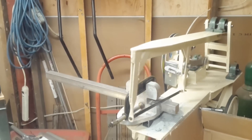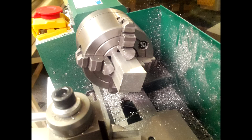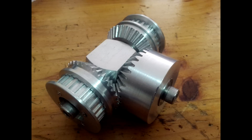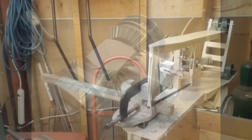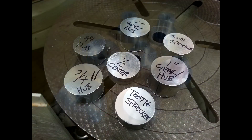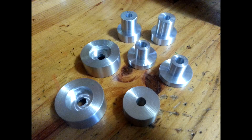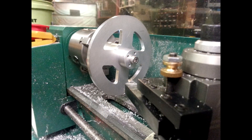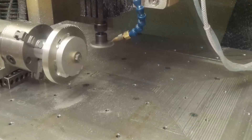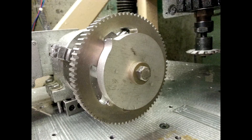More of this. This hacksaw worked nonstop on this project, I swear. It's a little square chunk of doodad, and there it is all milled and cleaned up. This is the center part between the gears, and there it is. That's the first part I finished on this whole project, and I was so proud of this gear assembly — I walked around for days just showing everybody that would listen to me. Again, more of this. And more blanks, and more milling, and more parts. Same procedure on all of these. These are the big gears. These were cut on the CNC, then turned on the lathe to the correct diameter, and here's a time lapse of cutting these gears. Exact same procedure. And here are the main gears all done.